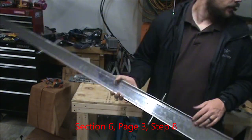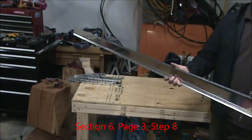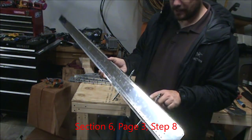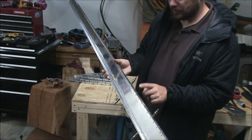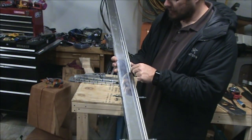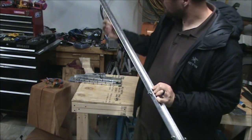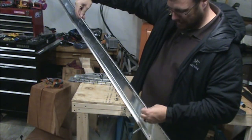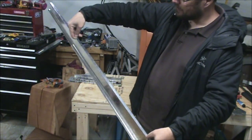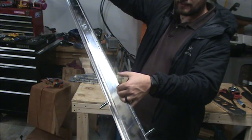So that was step 7 complete. Moving on to step 8, we have to machine countersink the holes that are common with the skin and the rear spar caps, this piece on the inside here. So basically starting at this hole up here down to here is the skin and spar cap common holes. The only deal is, because this hole was marked as do not dimple on the skin, you do not machine countersink it. So really, you start one hole up.